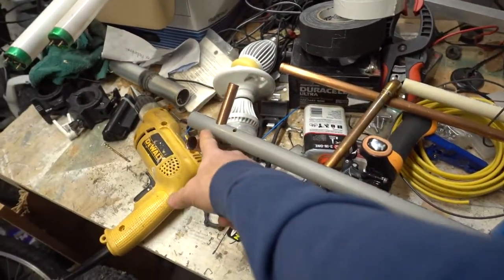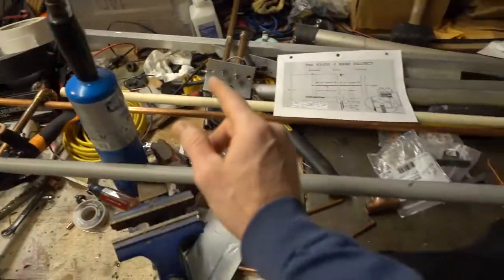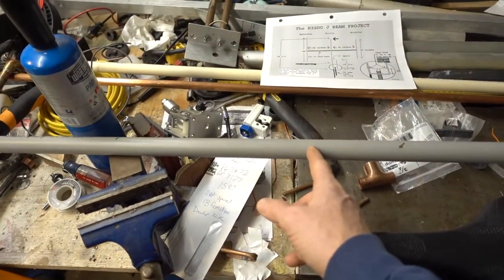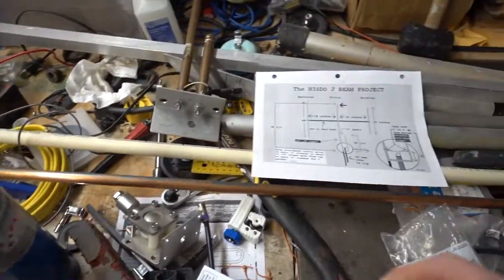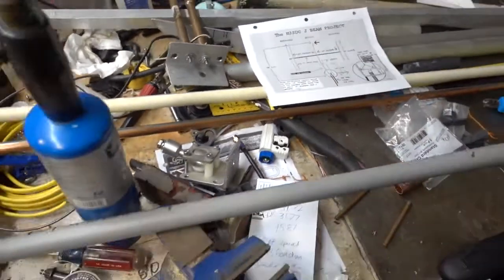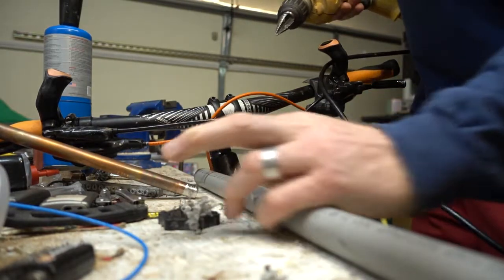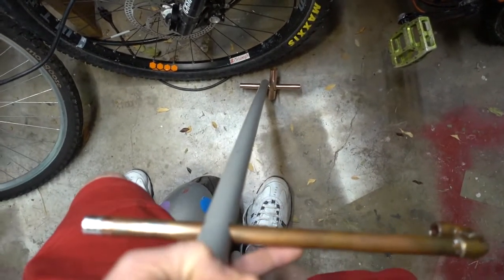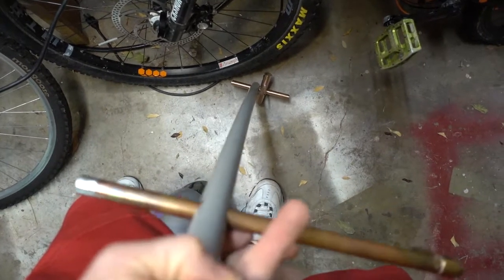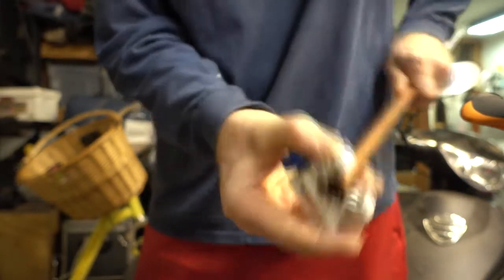The concept is a 40-inch reflector and a 32-inch director — this is for the two-meter band — out of the half-inch copper just laying around in the shop. They recommend cutting your J-Pol down a little bit, but I still want to use my J-Pol without modification. This is all an experiment because I'm using different size pipe. In drilling out the PVC section, I gave it a little bit of play so it wiggles, and at the furthest extreme on one side it lines up perfectly in-plane from the director to the radiator.